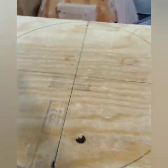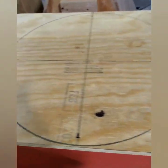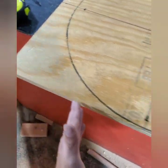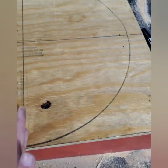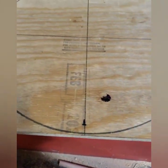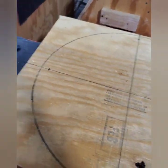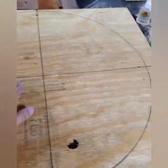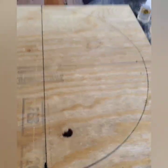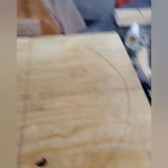I have to find the center of my sheet. I did that by first tracing my circle where it's going to be and then measuring in from the sides halfway. This length was 14 inches to the middle because it's 28 inches total, and from the other side it's two feet so I measured 12 inches in, drew lines with a straight edge, and now I know where my center is. That's where my main post is going to go, and then I'm going to have extra posts on each corner of the pie.